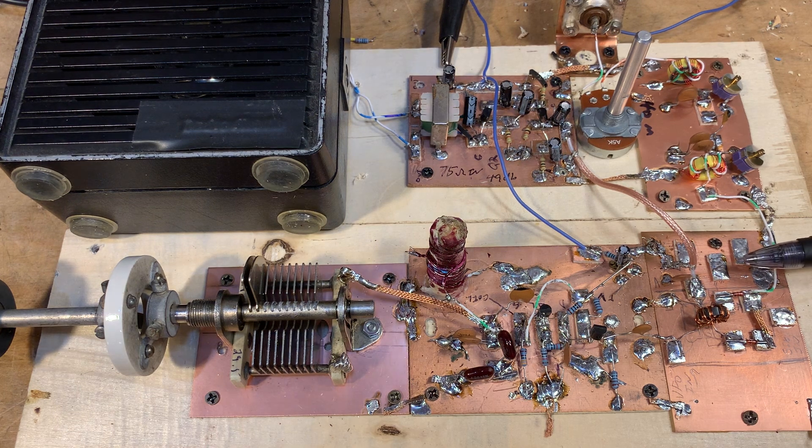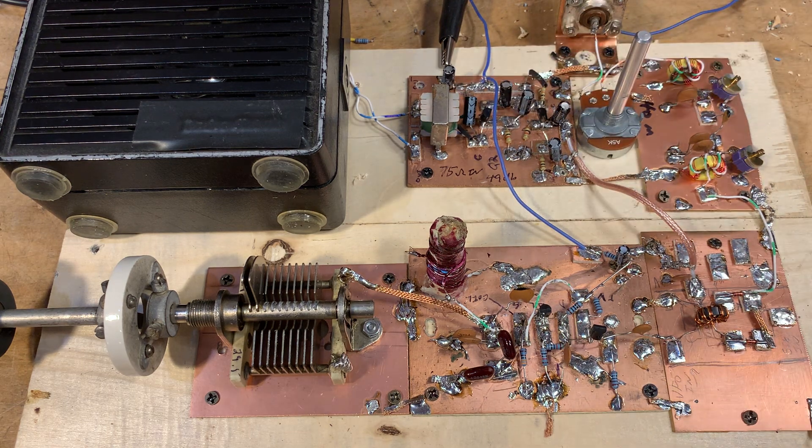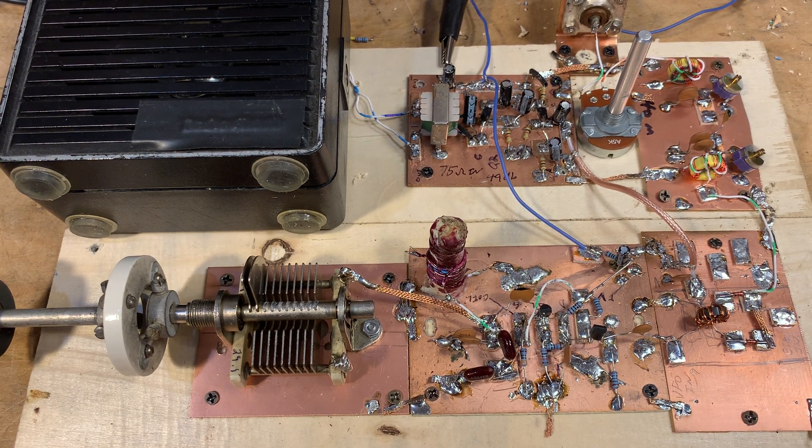Before I had a little FET audio preamp here — I thought it was kind of clever. But again, I tested it and asked how much gain am I really getting? The answer was very little. It seemed like more complexity than I needed, so I decided to keep things simple and take the audio out of this port and feed it into this little two-transistor AF amplifier. I needed a volume control because it was so loud that when I was using earbuds, it was hurting my ears.